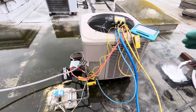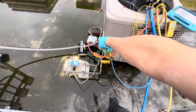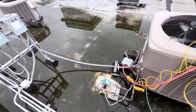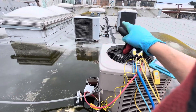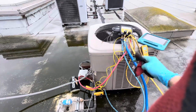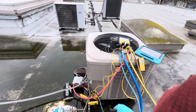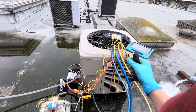Come springtime I'm going to need to look into whether the head pressure control failed or is out of adjustment — the fan should not be running non-stop. Here's a pet peeve: everybody buys these cheap carrier units with no head pressure controller, nothing inside — all straight on-and-off compressors. If you buy something like a Daikin, Mitsubishi, LG, or Samsung, they come with head pressure controls built in, with so many variable controls already included.